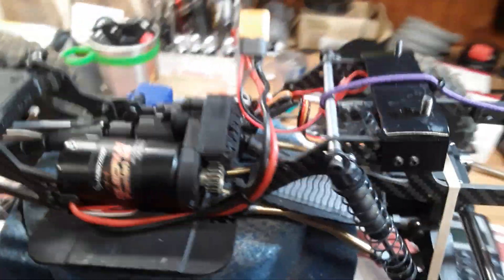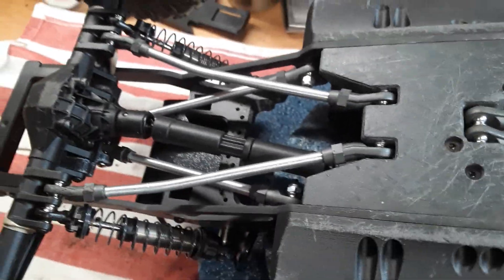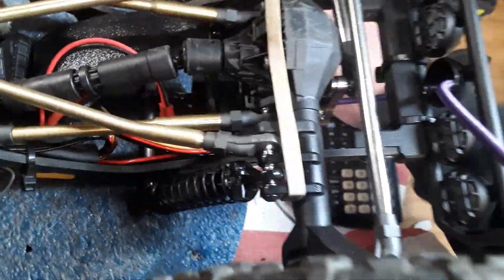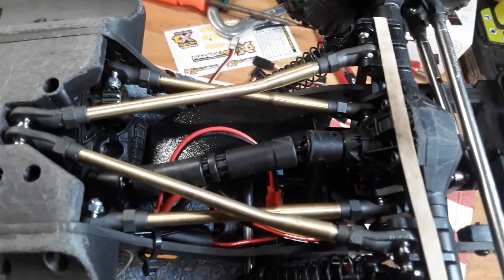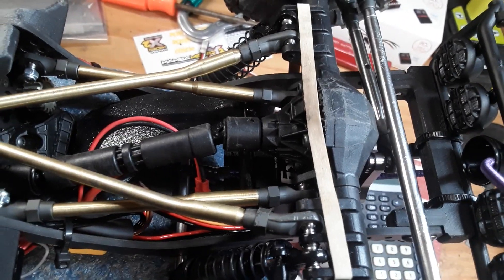Underneath here I made a set of links - aluminum in the back and brass in the front - and I tapered my links so they're heavier in the front. I've got a broken one here. I don't think anybody tapers their links, but I turned them down on the lathe and left the front heavy. I even thought about making them two-piece - aluminum in the rear and brass in the front.